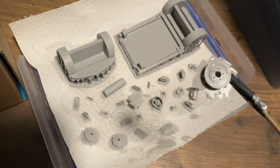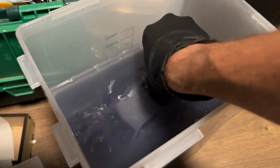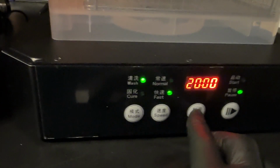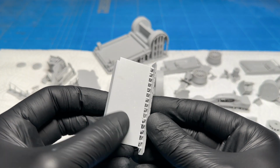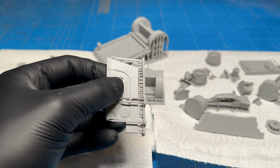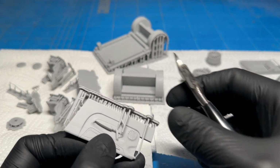So what I do is a pre-rinse in some dirty used alcohol, which will get rid of most of the excess resin, not all of it, but that does mean that the final cleaning step that I use will keep the cleaning solution cleaner, as most of the dirtiness is already removed in that pre-rinse, if you know what I mean. If not, do let me know in the comments and I can explain a little bit better. But basically I'm dunking the parts in two different baths, one for the first dirty stage and a second one for the final cleaning stage. And this will prolong the life of the cleaning solution, so to speak, a lot longer. The dirty one still works but doesn't clean as well as you want it to, but it does help keep the cleaning solution cleaner at the second and final stage, which gets you cleaner and nicer parts in the end.